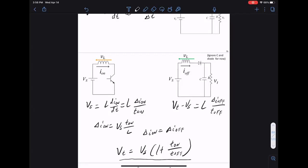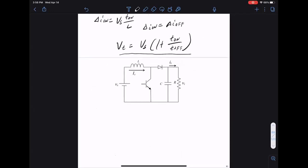All right, if no questions, let's think about what the capacitor and the diode do. Why do I draw this capacitor and diode? When you build a circuit, you do need a capacitor and a diode. But why? What's the point of these? During all these equations, they never showed up. So what does the capacitor do? Why do I need a capacitor in this circuit, assuming it discharges when the switch is closed? I think we're hinting at this: it will reduce the voltage ripples across the load, right?